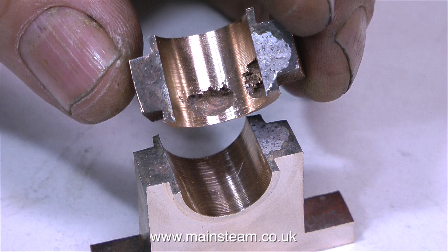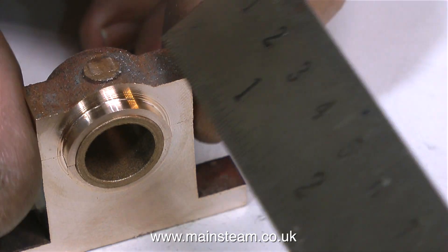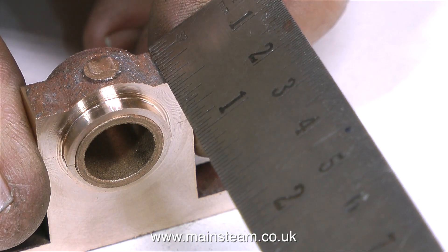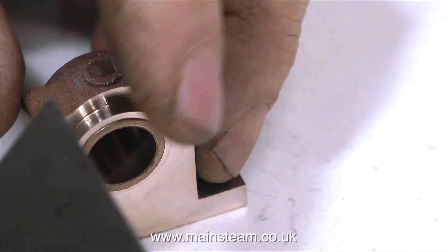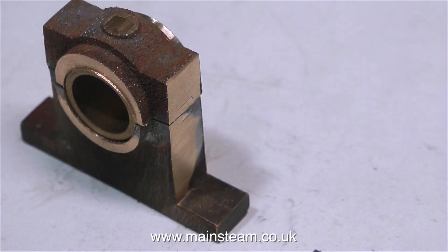As this is a modification using oilite bushes as bearings, I could use this, but I'm not going to because I would always know that the top bearing cap was a mess. Another thing about this bearing that's puzzling me is that on the drawing it says the bearing must be three-eighths of an inch thick, but this is three-eighths of an inch thick unmachined, so the entire casting is really undersized.